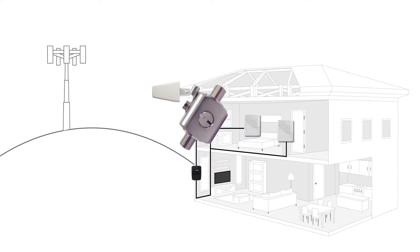With a lightning surge protector installed, the energy from the lightning would pass through the antenna cable to the surge protector and would be grounded there. The energy would dissipate at this point like blowing a fuse, keeping all of your equipment downline safe. Either way, there's no chance of lightning passing out of any of the connected components and into the building, so there's no risk of personal injury involved.